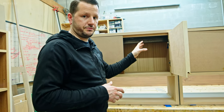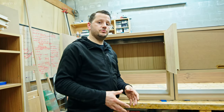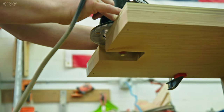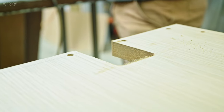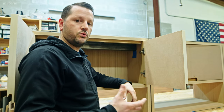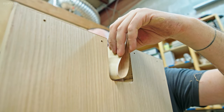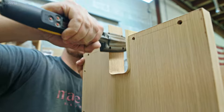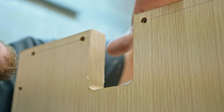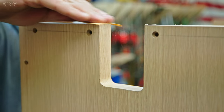We are going to leave this beam visible from the interior, so when you open these cabinets you will see that powder coated beam. When it comes to cutting the cases to fit this beam, we actually made a router jig to cut out the shape of that beam, leaving a little bit of room for powder coat finish and extra space for sliding that beam in. The blue tape here is to protect that edge banding while we were sliding this post in and out before finishing and before the steel is powder coated. We did go ahead and edge band all of these U shapes.